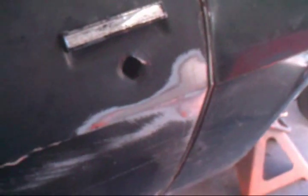There's a little bit of a bow here, so I don't know if I'm going to be able to get this to suck in a little bit tighter. Probably am, because I know I probably have to roll this lip up a little bit, and since I am going to butt weld this, I can actually take a little bit off of it and pull this panel down a little tighter, and that should help out.